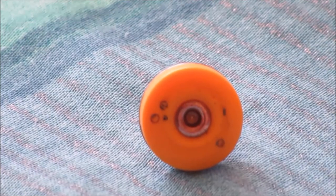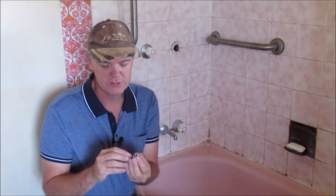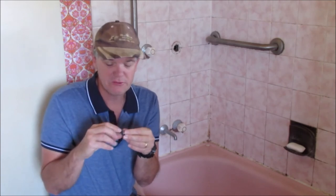I'll pull the tap all apart and the washer, as you can see, does have some bits of brass shavings in it, which is sort of what I expected. So I'll throw that one out and put a new one in. I'll check in there to make sure there's nothing else I can see now that I've used the shower a little bit. The other thing I'm going to do is put some thread tape on the new seat that I screwed in, to help seal the thread. What I realised is that the rubber gasket seals up against the old seat, but the old seat still has that crack in it - so water could be coming around those threads and then not seating properly. So I'll put some thread tape on here, put this back in, and put a new washer in.